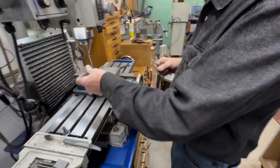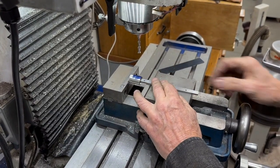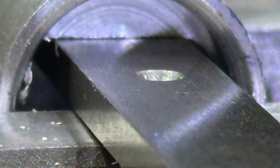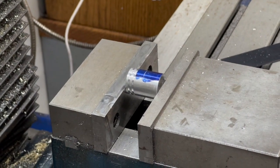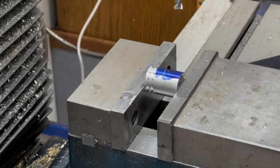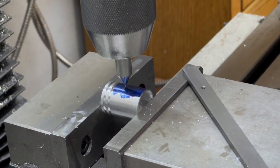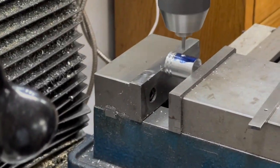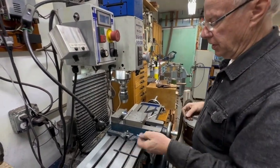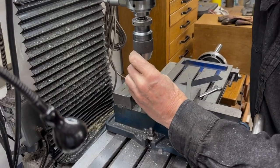In order to get that 90 degrees I'm going to put this in here and line that up by using a flat surface — you can see it's sitting on that flat. That looks pretty good. The next thing is to line up on that mark by eye — it's just about perfect anyway, a few thousandths off. We'll put a spot drill on that. It's calling for a 3/16 inch wrist pin with a reamed hole, so I'm going in there with a number 15 drill, which is a little under 3/16, and then I'm going to ream it.